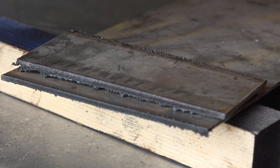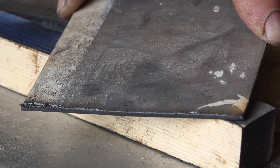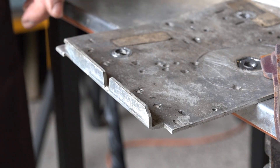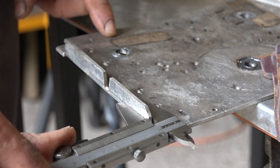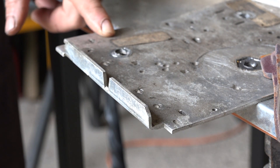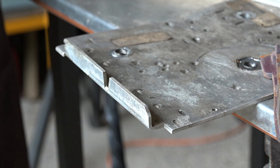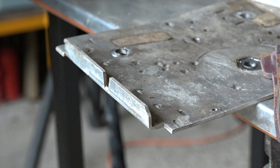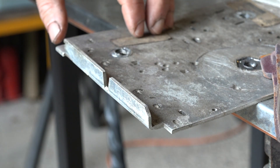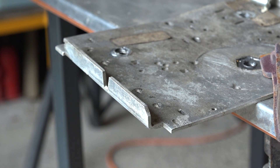That's a fairly nice cut on the inox — there's almost no slag on the back, cutting really nicely. Now we're going to try a piece of aluminum, roughly 3mm thick. I didn't clean it — it's a little dirty and greasy. I'm going to cut it freehand without a guide, using the same settings: 35 amps, about 5 bar. Let's see how well it works.